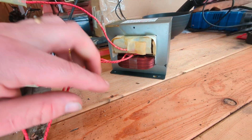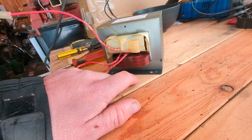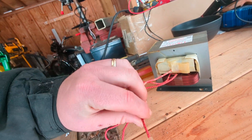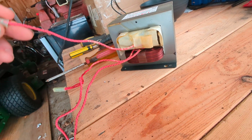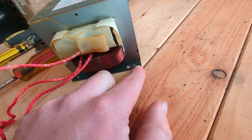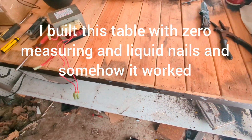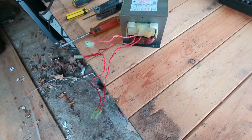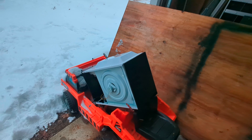If you're not familiar with how these things are set up, this exposed coil here is the low voltage — we don't really care about that. All we're worried about is high voltage output. Notice there's only one lead for high voltage. We're going to connect that to one of our wires going to the ends, probably using alligator clips. The second one we're just going to ground to the body through one of the screws. I'm going to get a piece of wood to mount this on. I've got to clip those off, get the other pieces off, get the power cord off, and go from there.